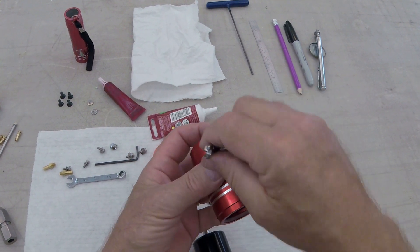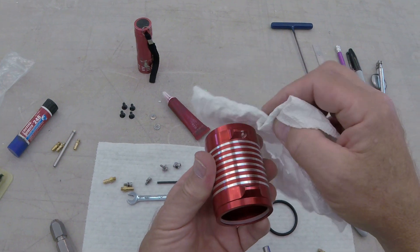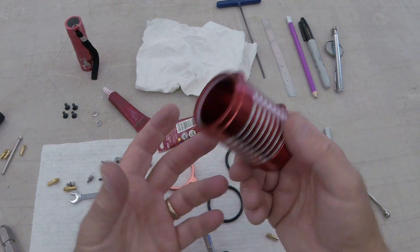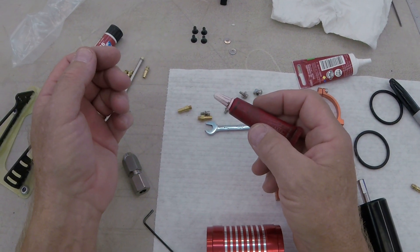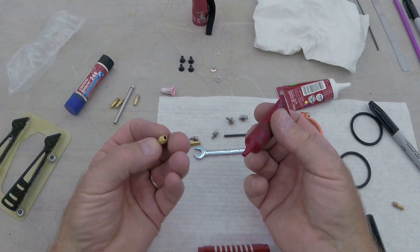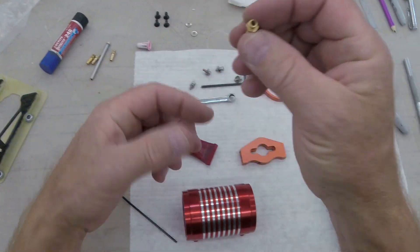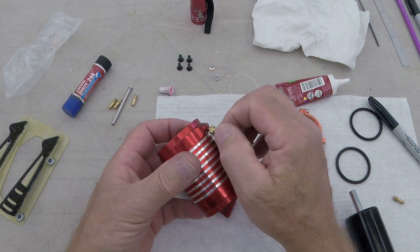The first one was a real booger and I was scared - I was thinking I should put some heat on it. But sacrificially for your sake I decided to just spin it and see if it was going to break so I could warn you, and it did not. I got a lot of excess on her. I dinged the anodizing - just kidding, we'll be fine. Now we're going to use red Loctite on these new ones. And I remember we don't want to tighten these super tight, because the material is super thin - if we go super tight, breaky breaky. Very sad.